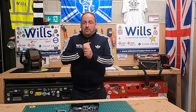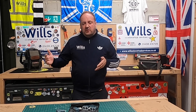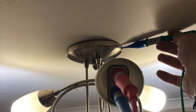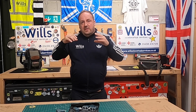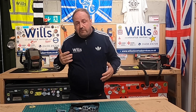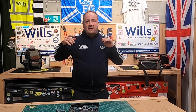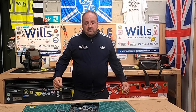Another really good use is when you're changing a light fitting — say a T-bar type. You second-fix it, take a loop, then put it out, but there's a period between testing and putting it out where you're juggling the fitting around. There's nothing to say the earth or live hasn't popped out. So now we use these — after second fix we can carry out a live earth loop impedance test before and afterwards to see if there's any difference in value.